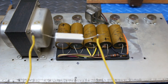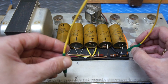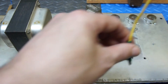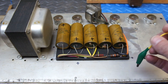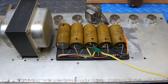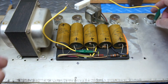To make a simple tool to do your filter cap discharge, you take a resistor, solder it to two wires, and put a pair of alligator clips on it. All you do is clip onto a ground — the negative side — anywhere, like a chassis screw or the edge of the amplifier. Then, without touching things with your fingers, clip onto one of your positives, ground it, and leave it there. That little setup will discharge your filter caps.